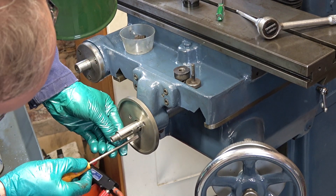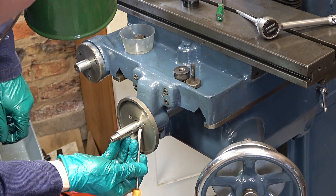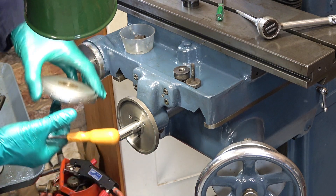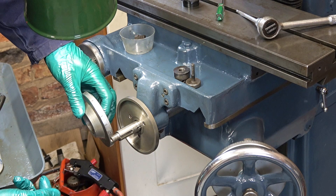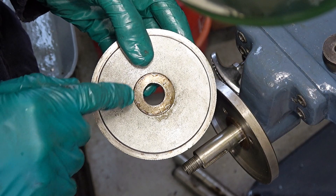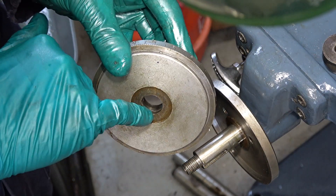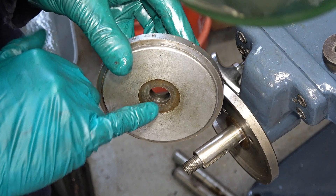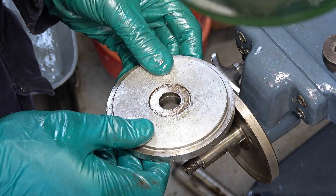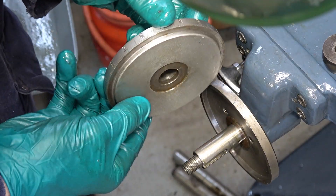You can tell these machines are handmade. That hole looks like it's just oiling the dial unit, not the bearing. But there is a groove in this dial in the centre — a little difficult to show — and it looks like the oil from the shaft comes into that groove. So they have thought about it.